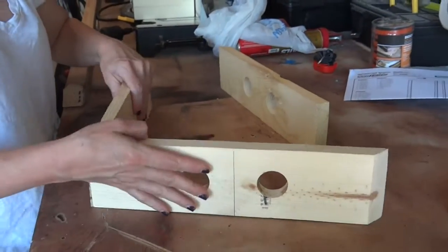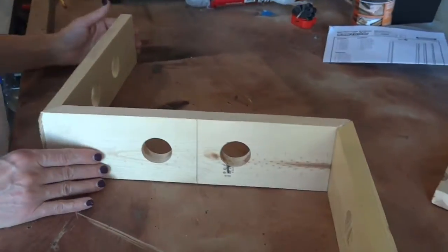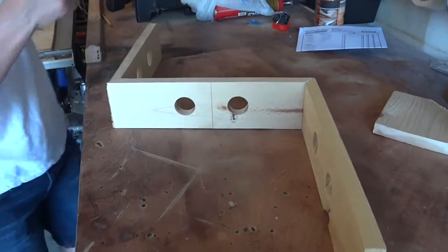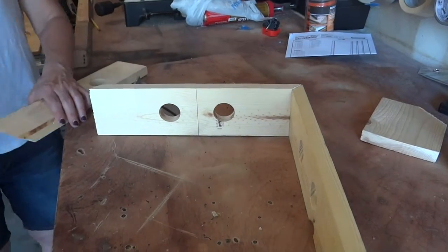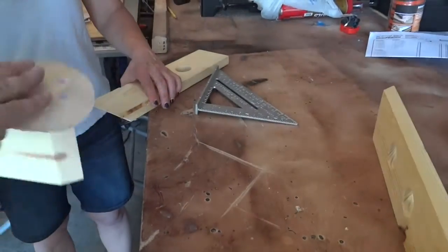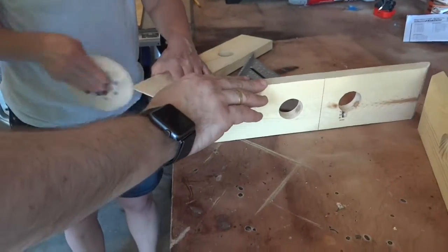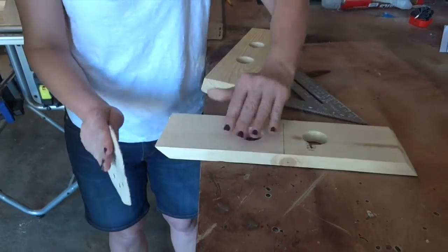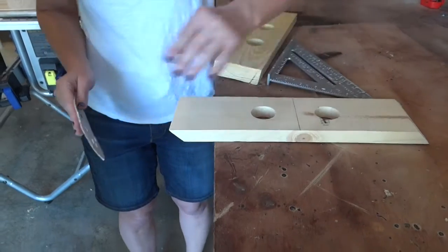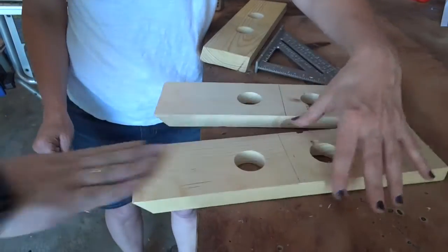So now here they are, painted black, and okay, we're doing the dry assembly of the angle pieces that have been drilled. A dry assembly is a great idea to ensure that your cuts are correct, so you will not start assembling the project and then find out that you have made a mistake in a dimension. Using a hand sanding process simply takes away the rough edges without risking damaging the wood or changing the angle or making the project more difficult to complete.